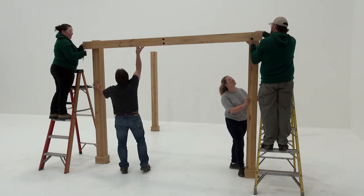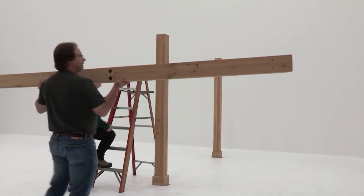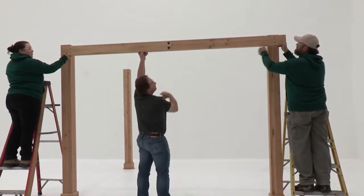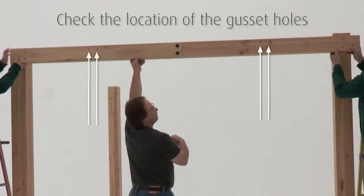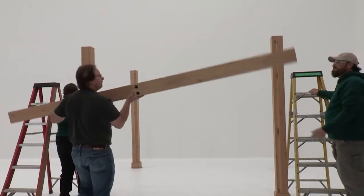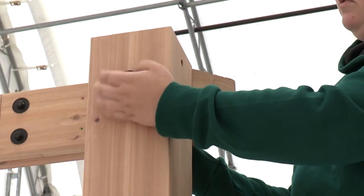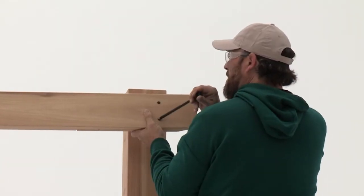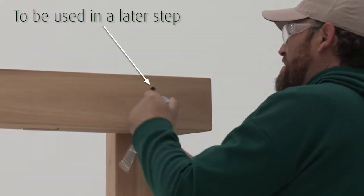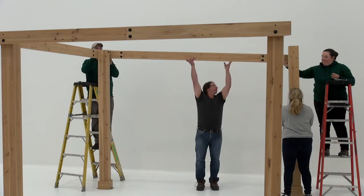Get at least four people to help with frame assembly in step four. Begin by positioning the four posts in the final location of the gazebo. Next, with ladders and a helper on each side, lift the first beam assembly into place against the top of two posts. Check the location of the gusset holes — if they're not at the bottom of the beam assembly, flip it over. Make sure the end of the beam is flush to the top and side of a post before attaching it with a hex bolt. Repeat to attach the other end of the beam to a second post. The second hole on each beam remains empty for now. Repeat each step to attach three more beams to the assembly.